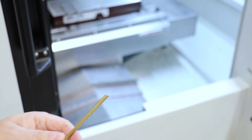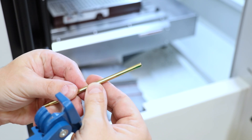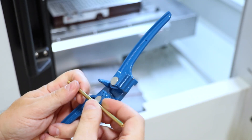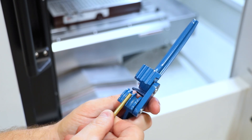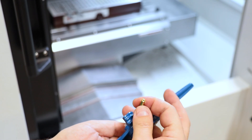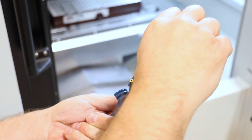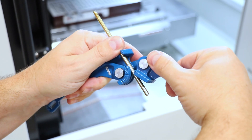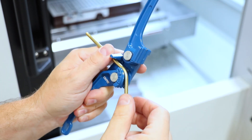This is just one application where you might want to bend the nozzle — say, to shoot air directly down at the cutter, around a corner, or for some special application. It's not something you do very often. This is a tubing bender set I bought for like 12 or 14 bucks off eBay. You just line up the nozzle, which fits right into that center groove, index it so the green mark is down, and put a little bend in it. It doesn't take much force at all. Nice smooth bend — leave it about like that. Now we'll take it back to the machine and thread it in.